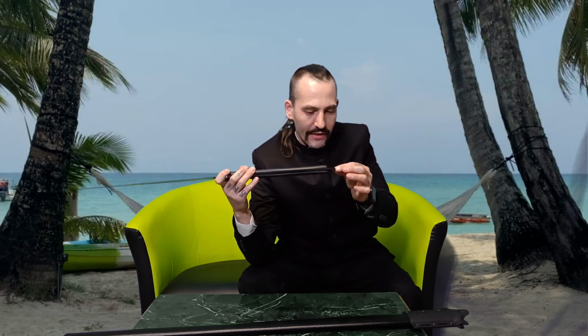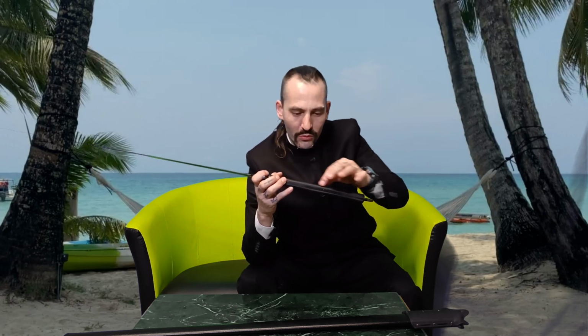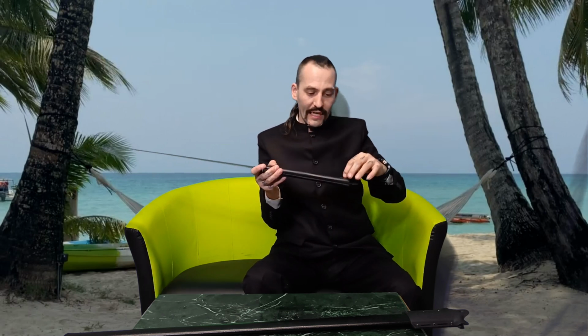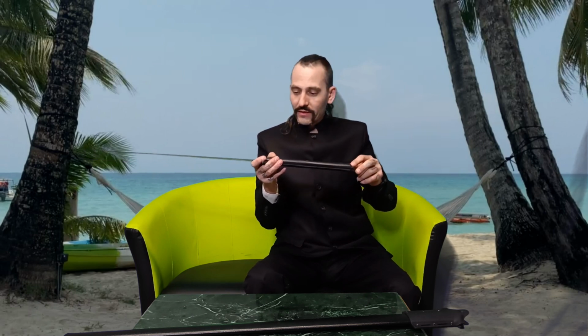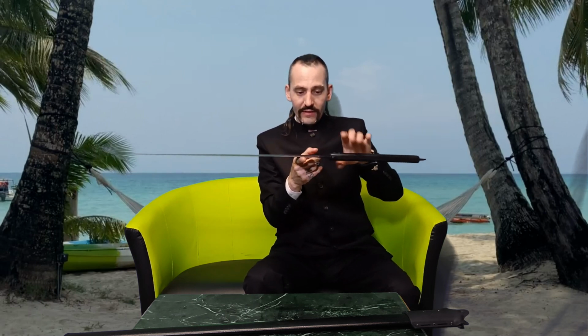Yeah, the full tang here may have put a little bit too much material away inside here. So I lightened it behind the guard, which puts the center of gravity in front, toward the blade. So I put it in front at first, and then with the lead casting I made here, I put a cutout in both G10 scales and filled it with lead. So I pushed the center of gravity back, and now, as said, it's around here.